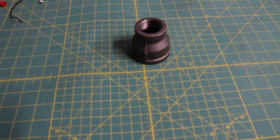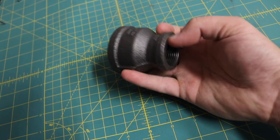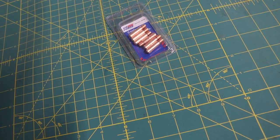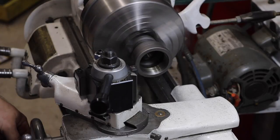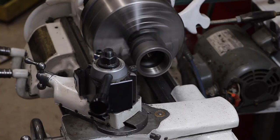The body of this will be made out of common black pipe from the hardware store and a reducer coupling, inch and a half to one inch. I also got some all-thread for the orifice to sit in, some flat stock, and the orifice itself will be a MIG tip — 0.025.